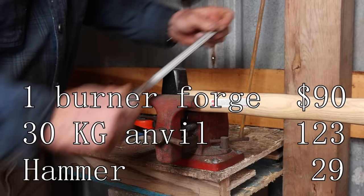You can take this 3/8 round bar, draw it out square, then shape the square in an octagon by knocking the corners off, then round that up and make a nice little round taper. And this is something you can do with some of that first piece of 3/8 round bar that we're going to use just as learning material. If you get good usable products that you can later sell, that's wonderful, but that's not necessarily the expectation. That piece of material is to develop skills with.